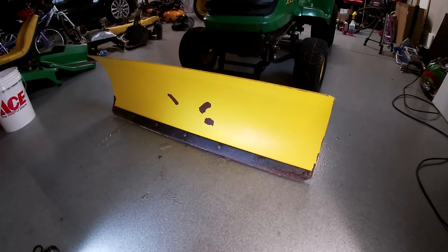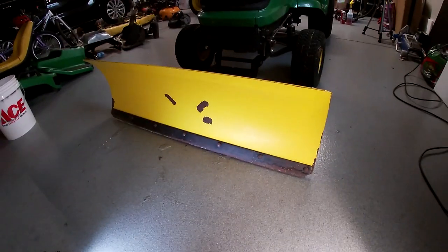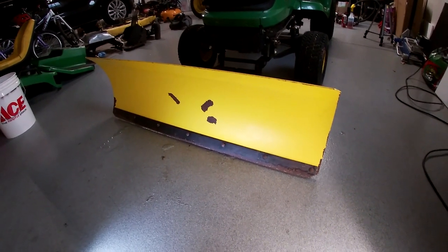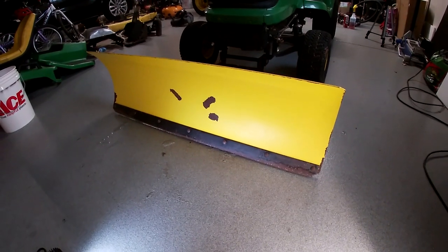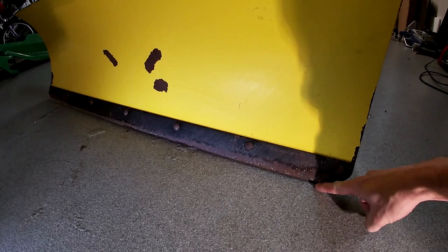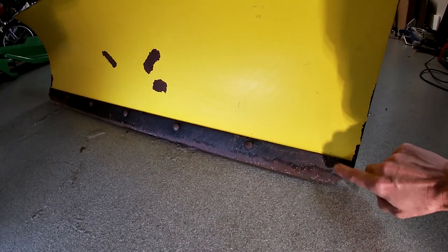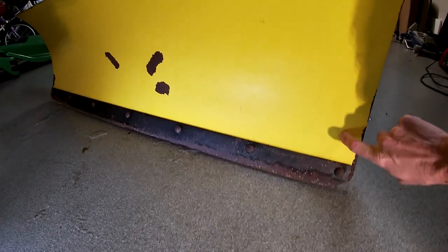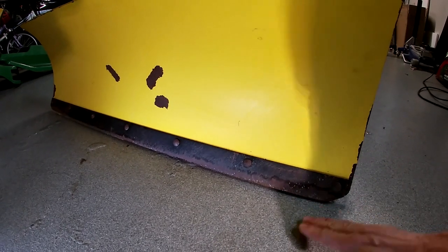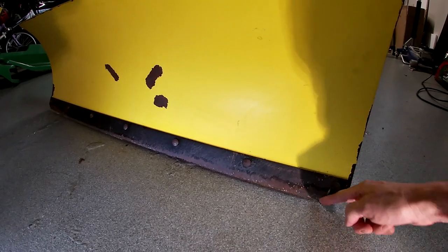So what's the goal here? The goal is to have kind of a soft edge on the underside of this blade that doesn't catch the concrete or bounce off the concrete real hard, and also cleans the snow away nicely. So what I've done is I set the blade about a quarter inch just above the ground here, and what I want to do is sandwich the piece of poly between the moldboard and the cutting edge. I want it a little bit longer so that it kind of acts as a cushion.